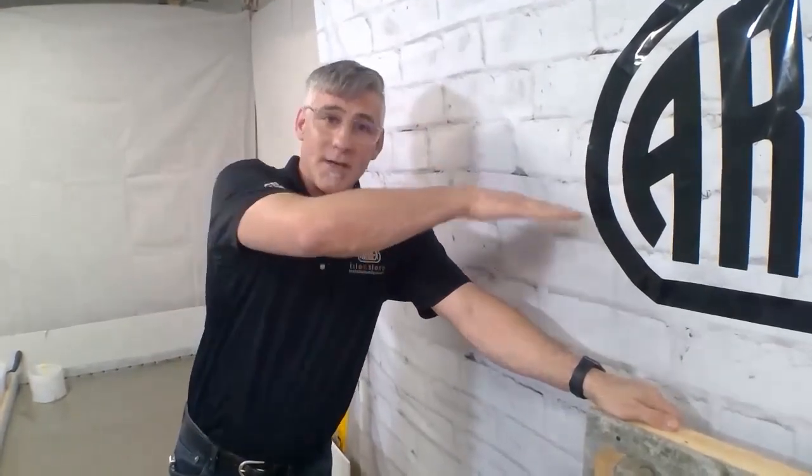We have a question from Tristan: should tile be set directly to liquid backer board, or should there be some sort of crack isolation or uncoupling membrane set over liquid backer board prior to tile installation? That's a really good question. An uncoupling membrane is going to act much like the cement backer board that we have here or any other backer board. It's going to follow that substrate. So if there's a hump in the substrate, an uncoupling membrane is going to follow that same hump. The beauty of a self-leveling cement or underlayment is that it's going to take those undulations out of the subfloor, and that's something that a backer board or an uncoupling membrane doesn't do.